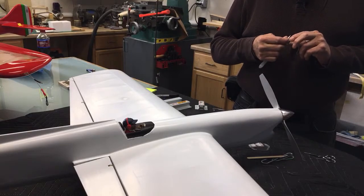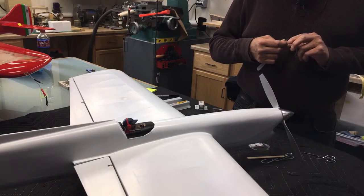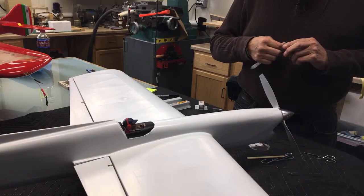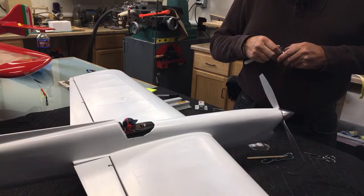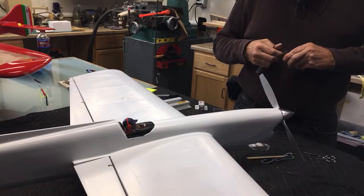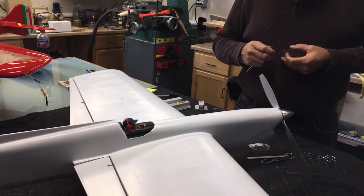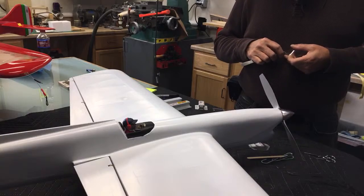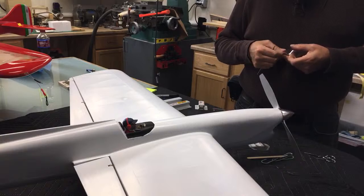That's all you're going to get out of that. Well, you're going to get enough out of it. You saw what I got out of mine. I had to use a little bit more, but you can add as much thinner as you want. I could get 4 coats, 6 coats out of it if I want, just keep adding thinner to it. But you've got to watch out at first if you're spraying over colors and ink lines. You don't want too much thinner in it right then at first, or you melt all that stuff.